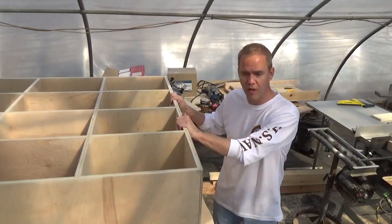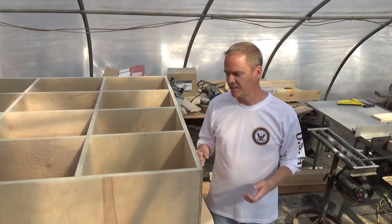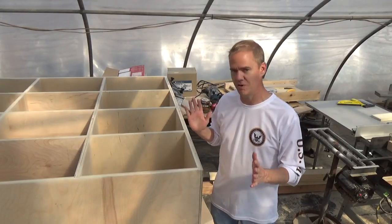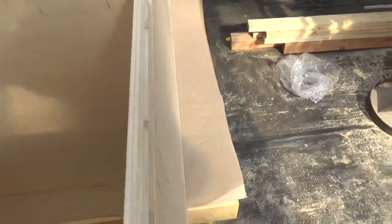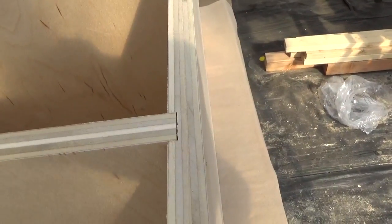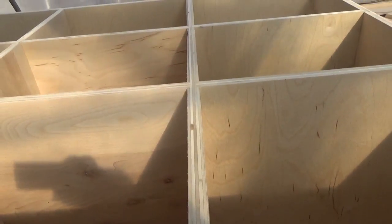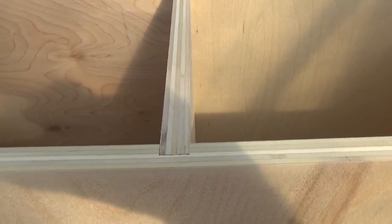That's one of the things about working with plywood. It's an excellent material to build furniture with. Again, it's very dense, sturdy, flat, straight. It's perfect. There is a drawback though, and let me just show you real quick. The downside with working with plywood is the plies are visible. And this one is 5-ply, and you can just see it everywhere. And it's not the best looking feature. In fact, when you're building something and you leave the plies the way it is, it takes away from the furniture itself, because all your eyes are just drawn to the plies and not the actual product.